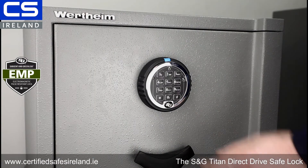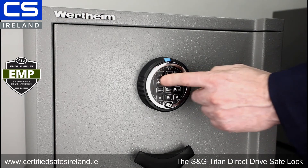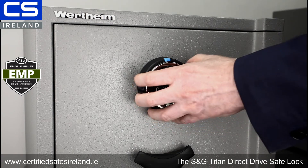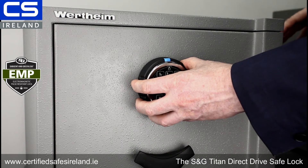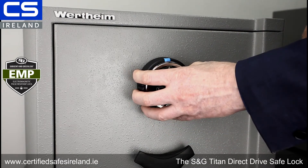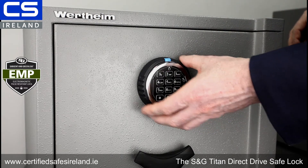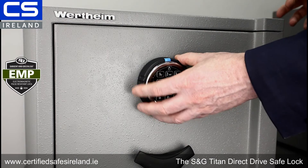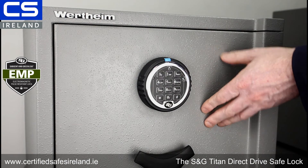The wiring should be on the inside of the door, with the cable going out the back of the safe to your alarm panel, so it's not obvious. In a duress situation, you put your code in but vary one digit by one — so if my code was one, two, three, four, five, six, I might enter one, two, three, four, five, seven. The lock behaves as normal but a silent alarm has been sent. In a domestic situation, police will respond very quickly. In a commercial situation, you may even have time delay on top of that, so it's a very powerful deterrent.